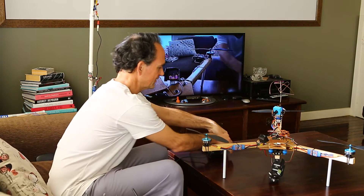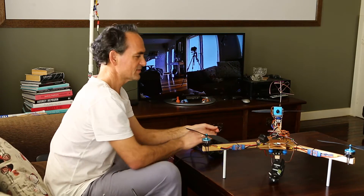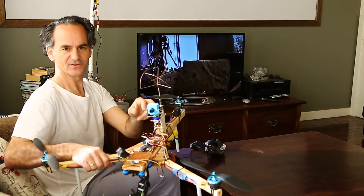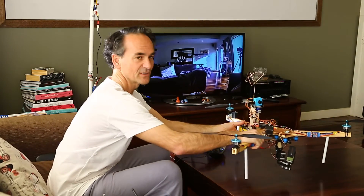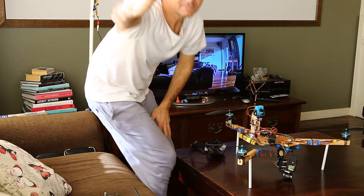The other thing I wanted to point out is that I had a bit of a problem initially setting this up because I'm running a 1.2GHz FPV system and it was interfering a lot with the servos. So I've installed a low-pass filter and it works like a charm — there's no vibration at all. Just keep that in mind.